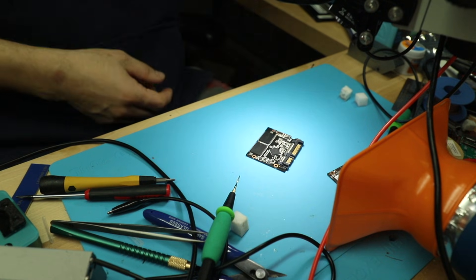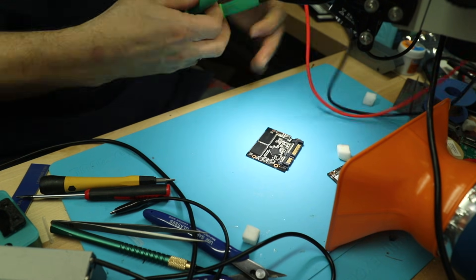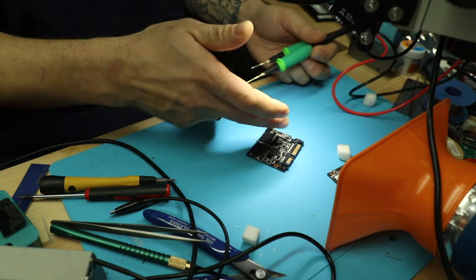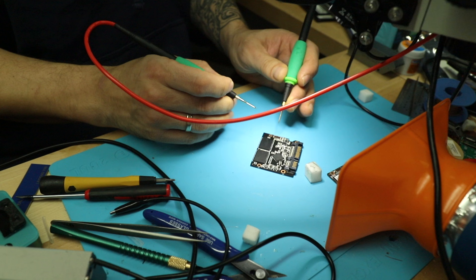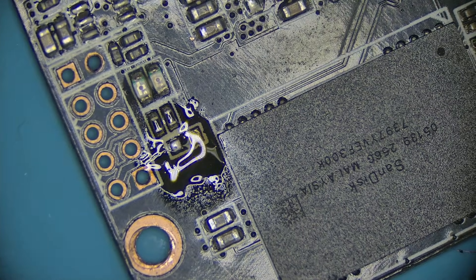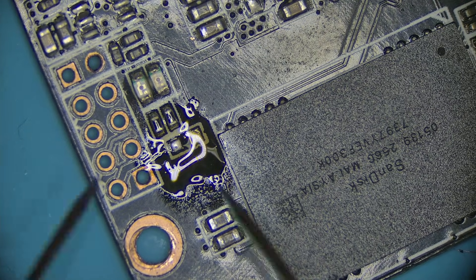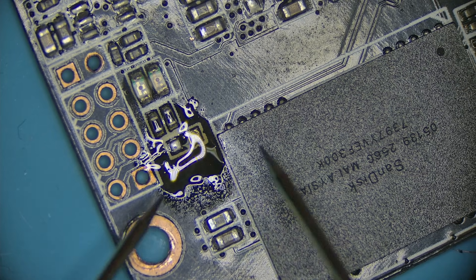Let's just make it all up with this guy here, going back to testing. If this capacitor was removed, maybe they spotted that the unit was getting hot over here. It doesn't take a genius to rule that out, but it also does not take a genius to check the VCC line before doing a bunch of soldering work. I should have checked.